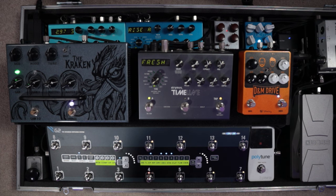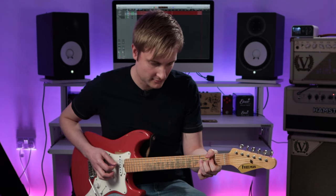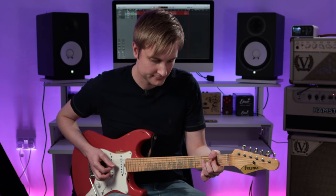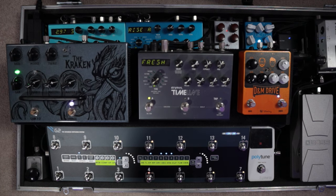So that's with the gain currently where it's sat — about two o'clock. Around that point is where tonally you can hear things start to get a bit thicker but it still retains all the clarity. If I dime the gain, it's not quite as open as before — a little bit more compressed, things aren't really coming down as much. If I pop it back to where it was, there's a little bit more dynamic headroom. If I back it off to 12, it's a little bit less thick sounding. With a more powerful humbucker that would obviously gain up a little more — we're kind of more into AC/DC type territory.